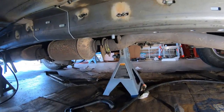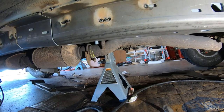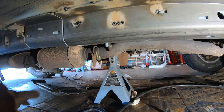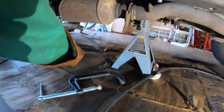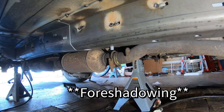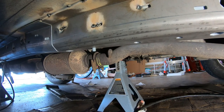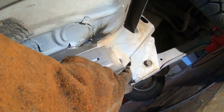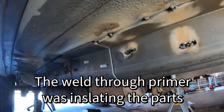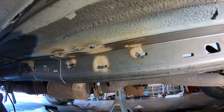Don't mind the ugly welds — I'm not a welder. I should have probably paid someone to do it. This is the stud for the transmission transfer case crossmember. I might have to pull that out and put in a bolt that's a little longer — it runs one stud and one bolt for that crossmember. Once you add these frame stiffeners, it may not be quite long enough, so I'm probably going to have to run down and get some more. I believe it's an M10. This piece is all tacked into place. I can't get the welder set up quite right — if I go any hotter it burns through, if I go any cooler I don't get good penetration. So we're going to go with this and just weld the rest of it.